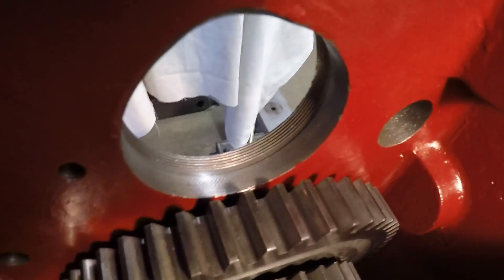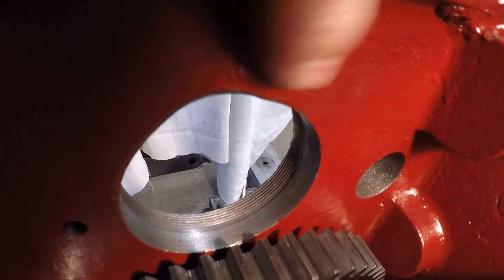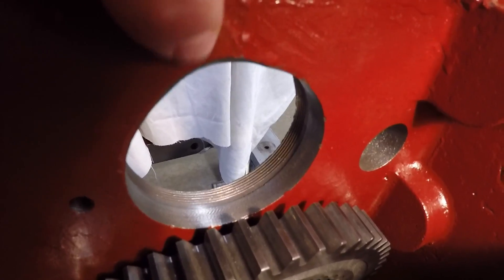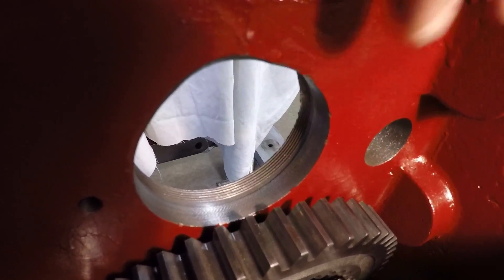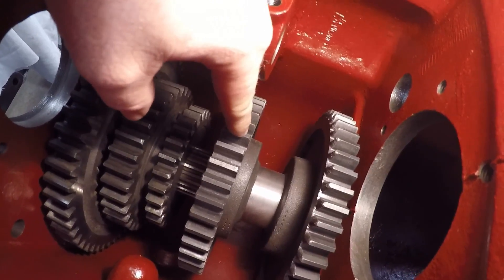One more detail to add: you can see we have this rather egg-shaped relief that's been ground in an otherwise perfectly round bearing bar. That's another modification the engineers had to do back in the day to give the back end of that already-disassembled top sliding gear shaft enough room to go into this back bearing bar — all because we cannot move the third gear. So I think we just found out why they decided to get rid of that steel spacer and fight with two additional snap rings on that lower gear set shaft instead. It's a pay-me-now or pay-me-later kind of thing, and they must have thought two snap rings were the lesser of the evils.